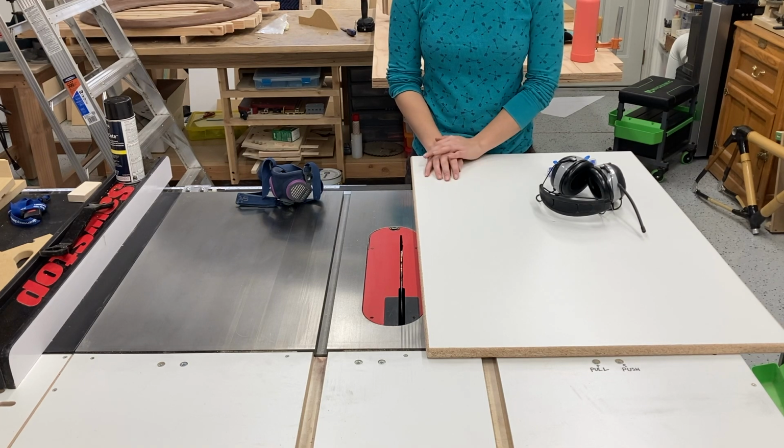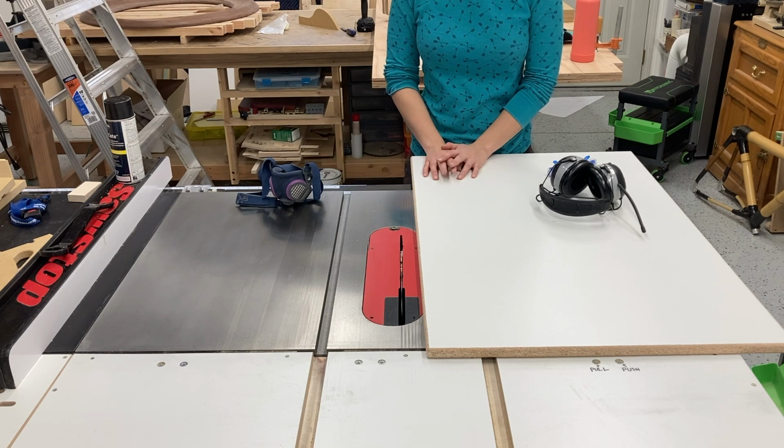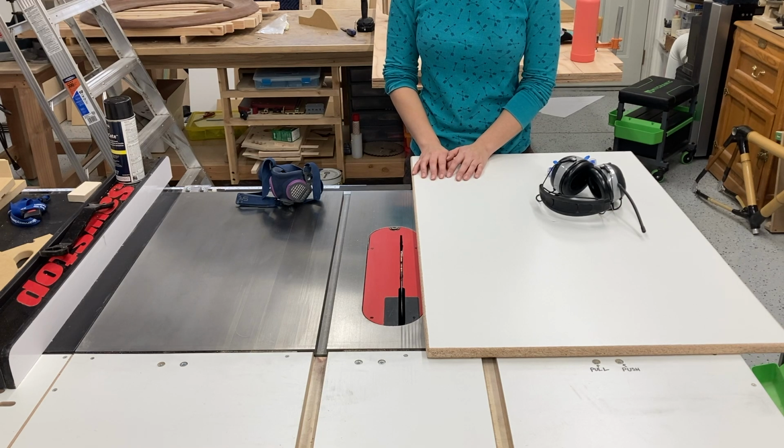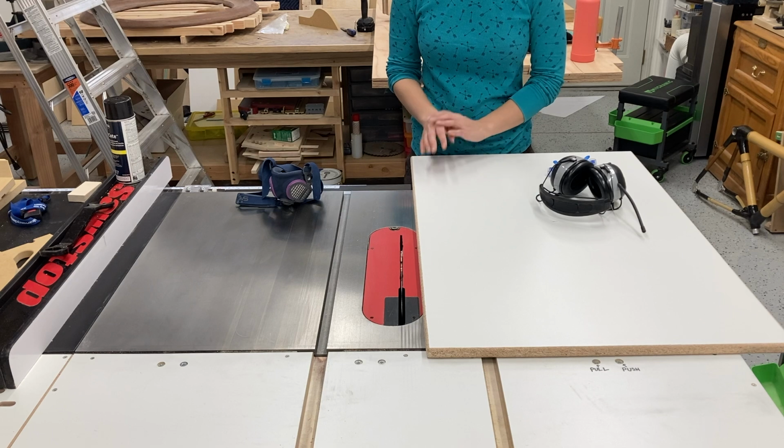Bags come in two different materials, vinyl and polyurethane. Polyurethane is significantly more expensive, but stronger and has more stretch and more puncture resistance. I've actually only done one glue up with a polyurethane bag, and it kind of threw me off a little bit just because I was so used to using the vinyl bag, because it's just so much more slippery and way less inclined to get caught on things.